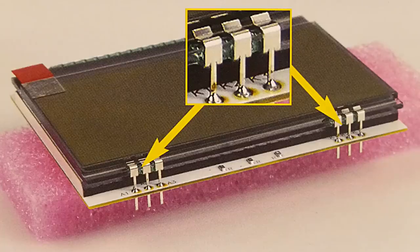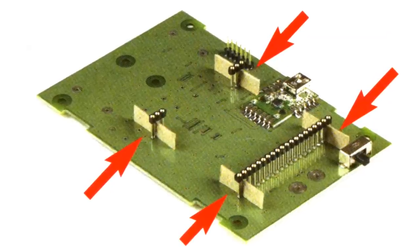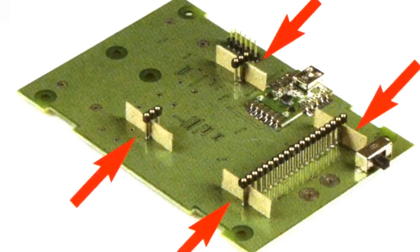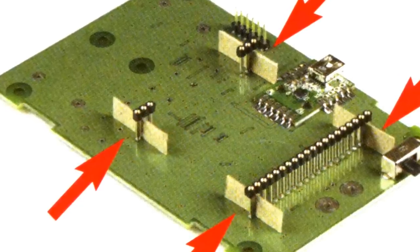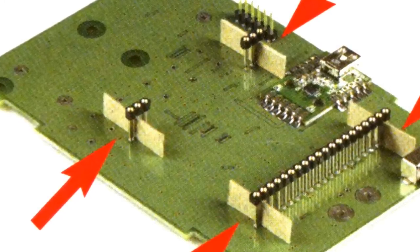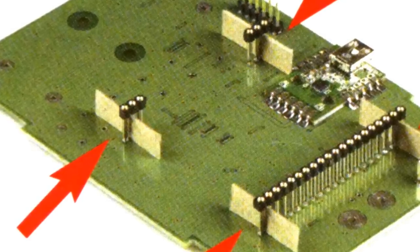In figure 5A, note which side of the LED backlight the soldering is done on — on top, not on the bottom. There's a cardboard spacer that you break into four pieces; it's supposed to measure seven millimeters wide but I measured it as six. Everything works though. The cardboard spacers were a pain and I used some scotch tape to hold them in place, then removed and discarded them once the components were properly positioned.